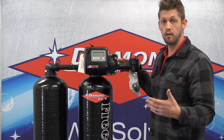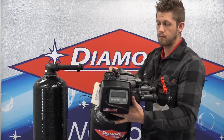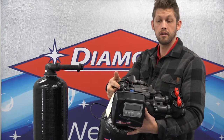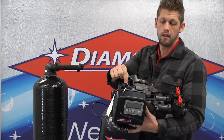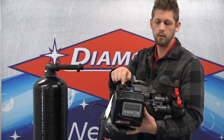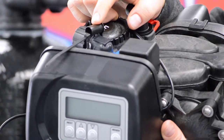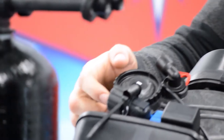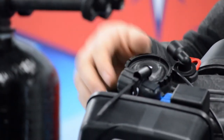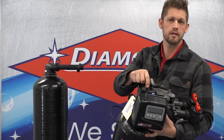Other items that come standard with your new Freedom Water Softener are on your drain line. You've got a compression fitting. There's also a poly tube insert that's zip tied to this so it doesn't go anywhere. This poly tube insert is used only if you're using poly hose, so that way when you use that half inch poly hose or 5/8 OD hose, when you put that into this compression nut and tighten it down, it doesn't collapse the hose. You'll have this poly tube insert there to compress against.